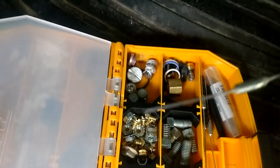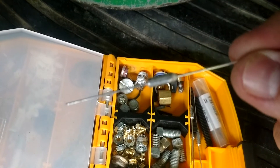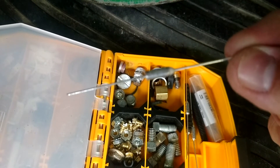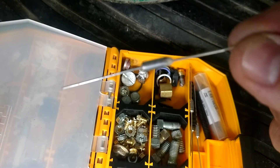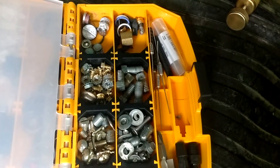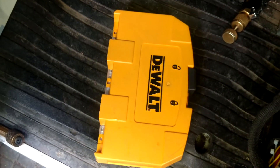Gotta have some of those. And these little guys come in handy on the fuse links on those old Carriers with worn heaters where these things would pop. I found you can just keep some of these, and I keep a soldering iron on the van — you can unsolder the old ones, clip these to fit the size, bend them, and re-solder them back in. Works great, never had a problem. So that's a repair you can make if you don't have the part on the van.